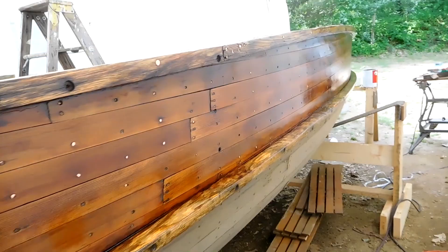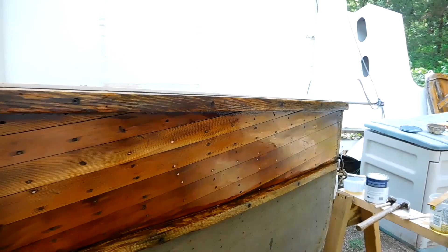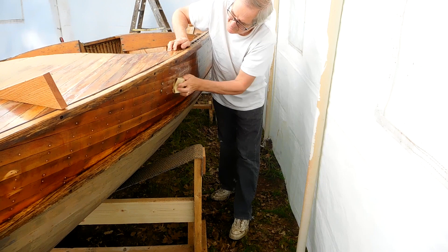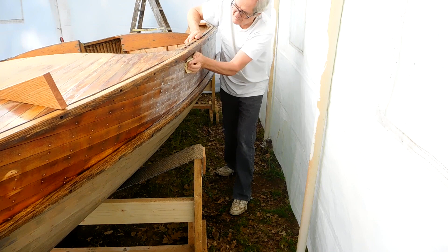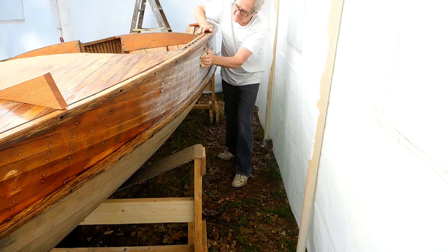Here's how it turned out with two coats — I'll put one more coat on after this one. You can see where the old numbers bled through; one side you can really see it a lot, and the other side it was a little bit light. I'm sanding with the 440 and wiping it down again with denatured alcohol or acetone. Acetone is fine, but it evaporates so fast it's kind of an expensive way to do it. This is just to get the high spots out — the sealer does leave fuzzy things sticking up, so this will take all those down and get it ready for a second coat.